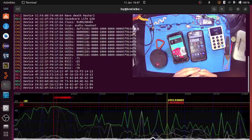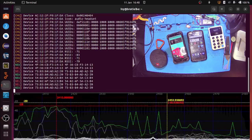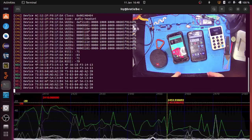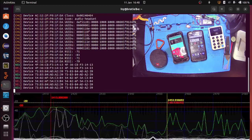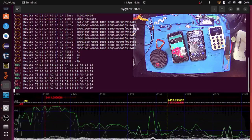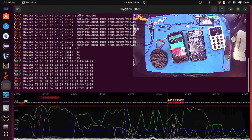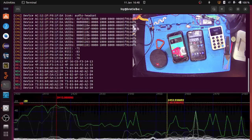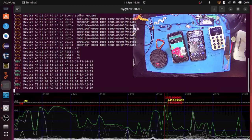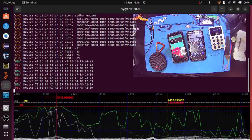There's a problem with that, and that problem is the dielectric constant of soil - the relative permittivity of soil - which is quite high, in the late 30s to 40s. That is attenuating the signal off and the signal just can't get through. Even 300mm of soil kills it dead, especially at 10cm wavelengths like 2.4 GHz. I'm going to do a video where I dig a hole, bury a phone in it, play some music until the music stops, and also show the spectrogram so we'll see the signal attenuate off and die away. This one's busted - it's my fourth video on this.